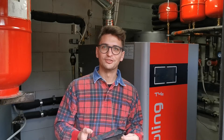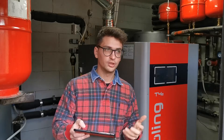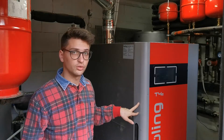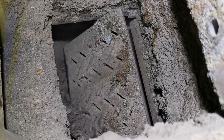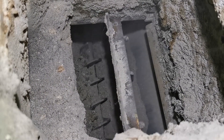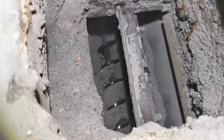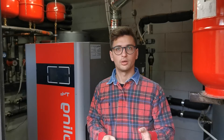These air holes are obviously needed for the combustion. Please notice the plate at the bottom — they are not holes, they are tiny slots. At the start of the procedure, the boiler cleans the heating system: this plate tips 110 degrees to remove accumulated material on it. You can see the plate rotates and cleans, and all the residuals fall down onto the collecting screw that brings material out into the ash collection box.